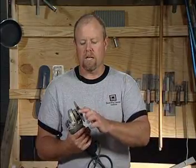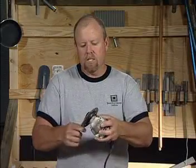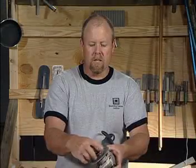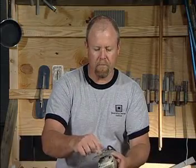Look at the quality of the diamond that you're using. That's very important. You want to look at the life of the grinding disc, but also make sure it's not raveling the edges. Again, most of your standard grinders will come with a tool that allows you to take it off. Once again, you're locking it back into place, but it's simply, you have the mounting bolt or the nut, it simply comes off and fits on here.